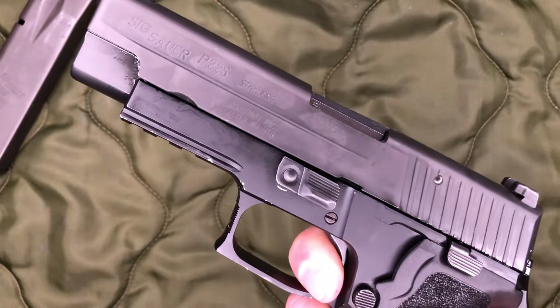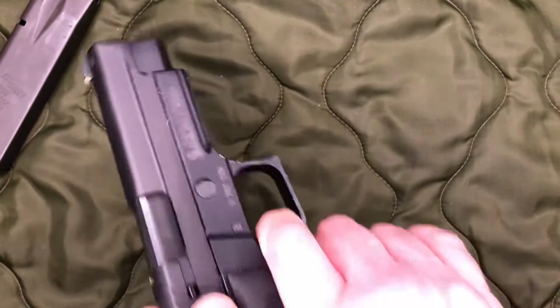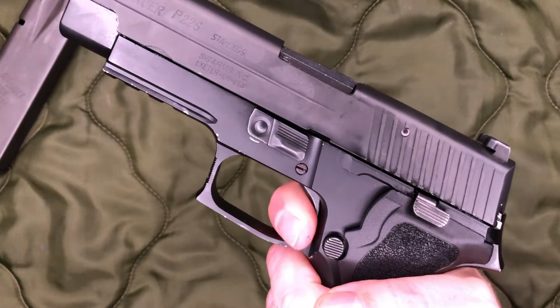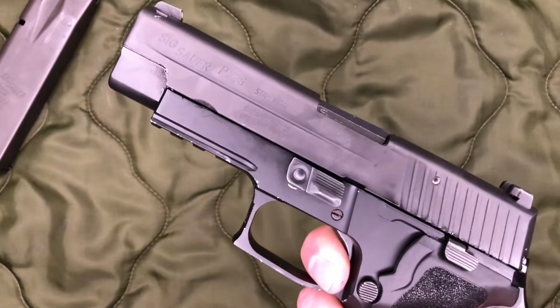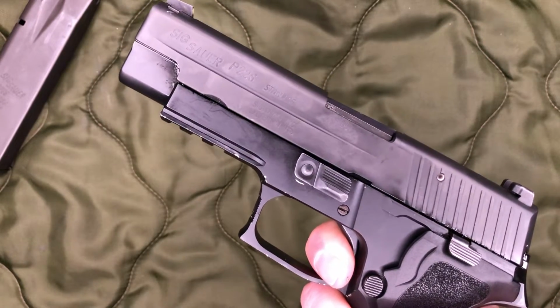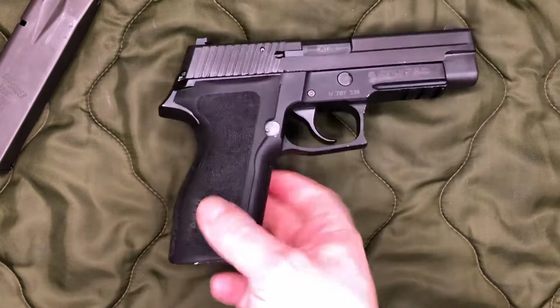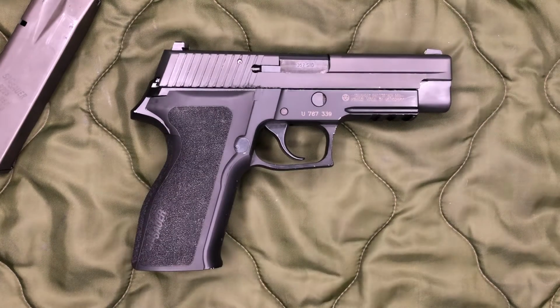And that blew my mind. And then the short reset, that guy there, went down to 7 pounds, 7 ounces, where originally it was 9 pounds, 15 ounces. I redid an average trigger pull, especially on the heavier trigger pull, just to make sure I wasn't messing anything up. And I kept roughly getting that trigger pull weight.